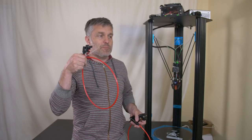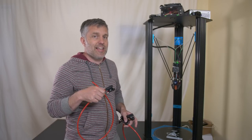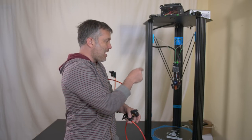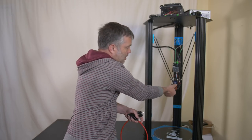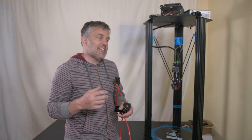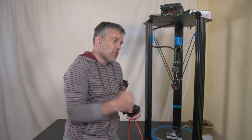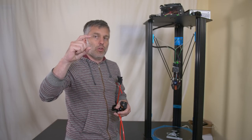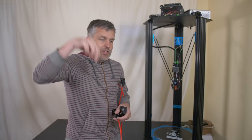I was actually skipping the gears, but that's not Zesty's fault. I'm really throwing an extreme use case at it, trying to tax this Nimble by pushing very rapidly through that long E3D Super Volcano hotend, and there's a lot of resistance in that Super Volcano hotend. You really do need the strength to force that filament through — it's just the long melt zone, all that friction.